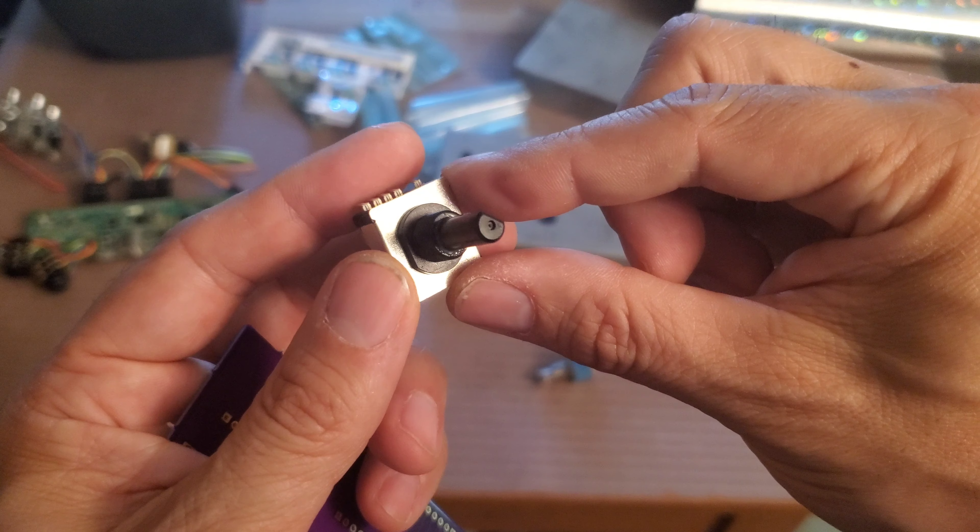What I'm going to do next is see if the knobs I've chosen — I've used them in many designs, I think the part number is PK110KH — can be laid out pretty densely. This is a one-of-sixteen selector. I wanted 8 or 12 steps but couldn't get those right now, so 16 it is. My point is I had to draw all of these layouts by hand in KiCad based off the mechanical drawings, so I don't even know if these fit. Let's do a test fit now — cross your fingers.